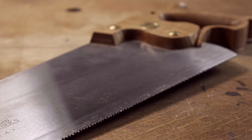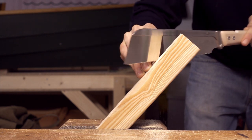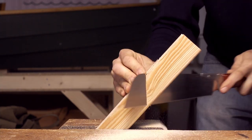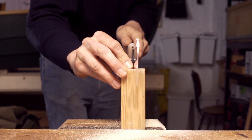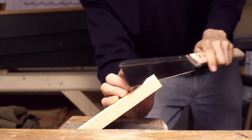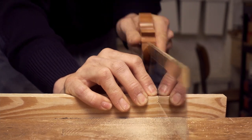There are two main types of saws: Western and Japanese. Western saws cut on the push stroke, Japanese on the pull stroke. I use both and they both work great as long as they're sharp. Most people new to woodworking love Japanese saws because they are very easy to start in the cut. The downside of a back saw is that the back limits the depth of cut — sometimes you will need to make deeper cuts which can only be done with a backless saw. Some saws have teeth shaped specifically for rip cuts along the grain or cross cuts across the wood fibers. In boatbuilding you rarely do pure rips or pure cross cuts with a hand saw, so I like hand saws with a universal tooth shape that does both types of cut fairly well. That said, both a rip and a cross cut saw will do the job just fine as long as it's sharp and relatively fine-toothed.